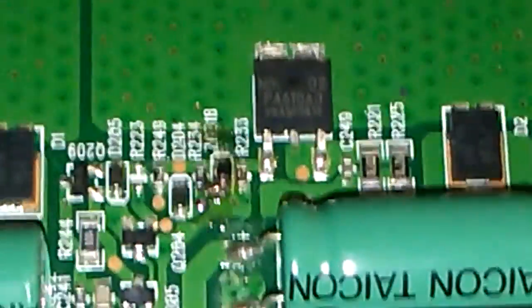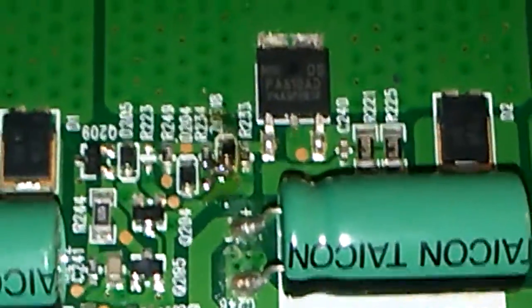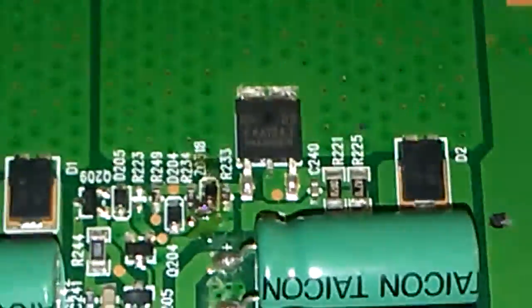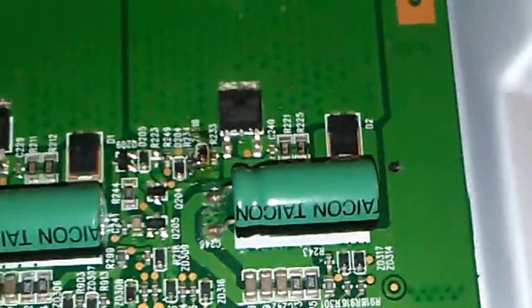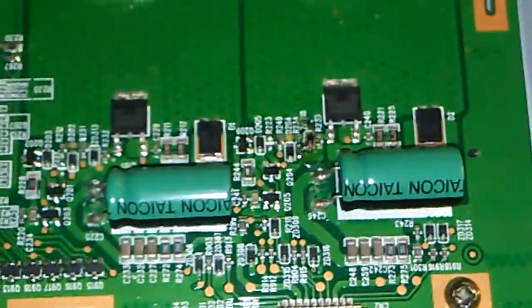And I finally caught a spark, which came off this tiny little thing called a Zener diode. Yeah, it looks terrible, right? That's not the damage from the short, that's my soldering skills. These things are so tiny. I did find one off another board and managed to get it soldered on there and got it powered up. And hopefully that's it.